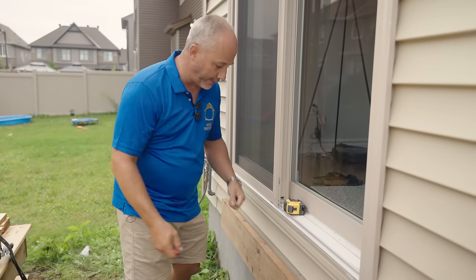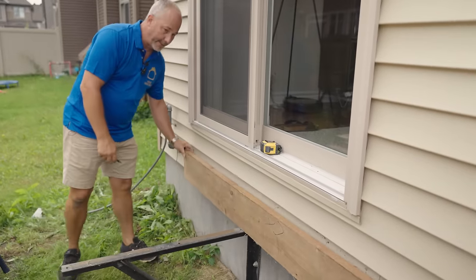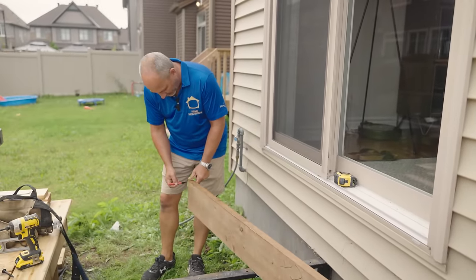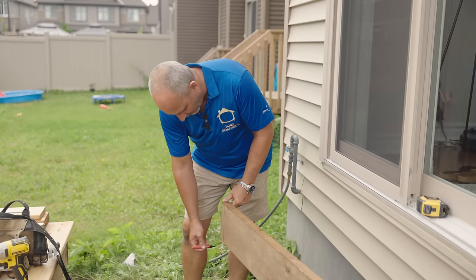When you're building a deck, something structural like this that's cantilevered, you wanna treat every one of these joists like a rim joist. You wanna double it up. So times 2, okay? And when you get to the end, you're gonna wanna do this. You wanna have this one be the widest, and the second one you wanna have it come 1.5 inches shy,